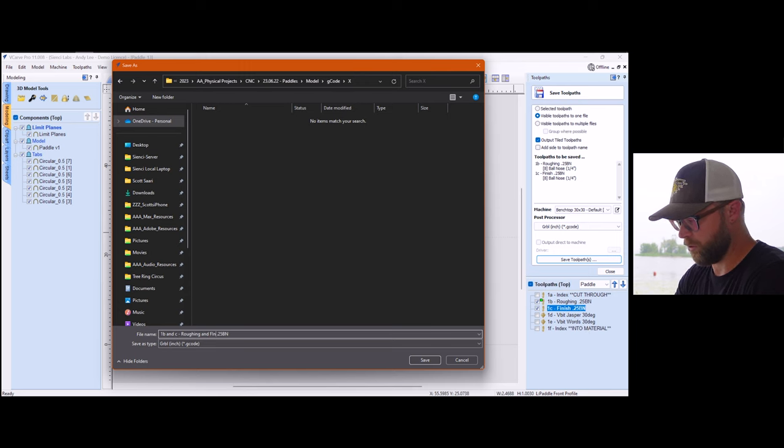This one, we are going to turn tile toolpaths back on, and you're just gonna say, Scott, why? And I'm gonna say, because if you don't, it is gonna save that toolpath at 47 inches long. Well, that's no good to us. We want it to be at the slide depth, right? I'm gonna show you. I'm gonna open up GSender and show you why we have this checked on. So we're gonna hit save toolpath. Because we have it clicked on, it's gonna give the delineation, save.